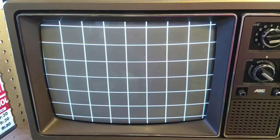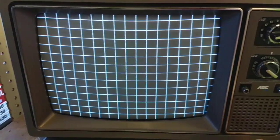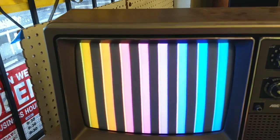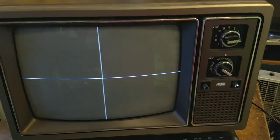Let's go for a finer pattern — yeah, that looks good. That looks even better. Convergence is pretty awesome. Let's see — fine-tuning. Auto-color is probably going to make it way too wonky. Color bars — that looks all right, it's pretty bright. We're kind of missing our red shift though. That's a little better. You really got to move that tint control way over to get the proper red.